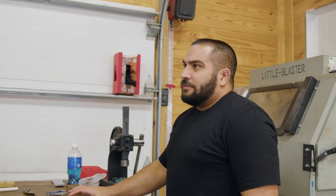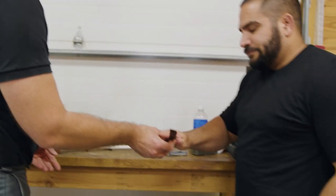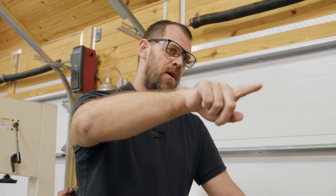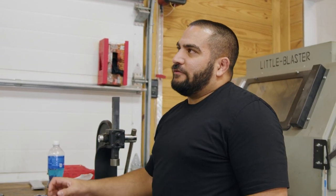There are things they don't tell you about, like fixing your angles. What sharpening really is is accurate repetition. Using a 440-grit stone and a leather strop gives a great edge — you can take it higher, but you'll likely get a longer lasting edge. I had a guy who did one of the knives and skinned five deer before needing to re-edge. The problem with most sharpening videos is you're watching them from stone manufacturers who want to sell more stones, so they show you using more and more products.